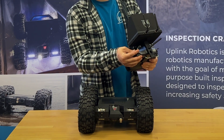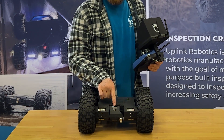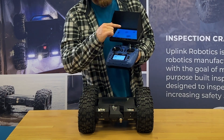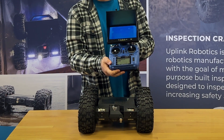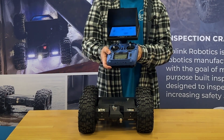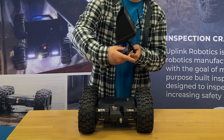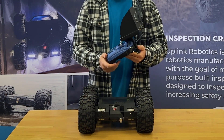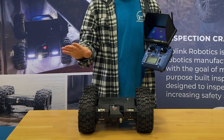To start recording, flip the switch up and down once — it'll start recording. You'll know it is recording because you'll see this light flashing, and also in the video monitor there will be a little red light blinking right up here next to the battery indicator. That's how you know it is currently recording video. To stop recording, flip that switch one more time — the light is now solid again and the recording indicator went away, meaning it has saved that video and is no longer recording.